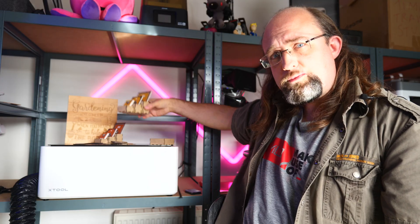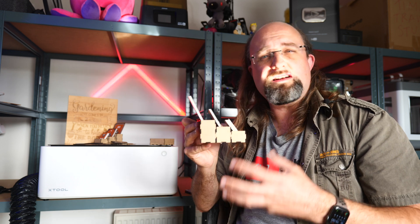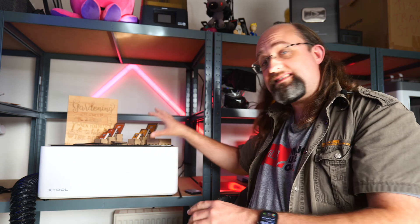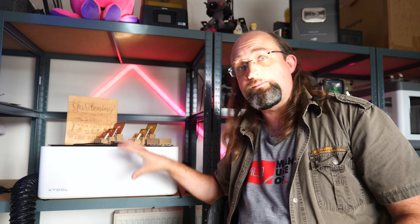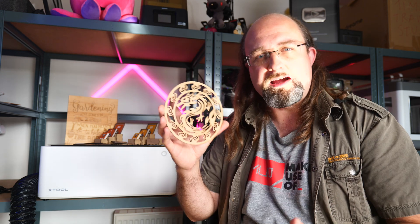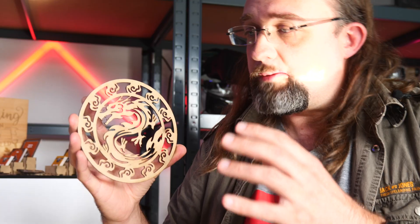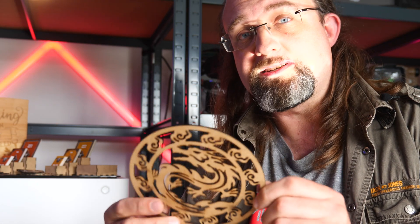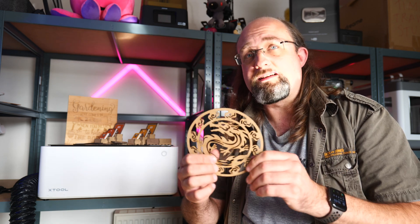I also tried with some 2mm MDF. I had to slow it right down to cut through even at 100% power, but it came out very nicely with very clean lines. You can see from the sheer number of boxes I made — and this is only about a third of them — what I mean about this being the most efficient, fastest, easiest-to-use laser cutter I've ever tried. The exact positioning camera meant I could really utilize every bit of MDF. I also tried something with really fine details: a Dragon Coaster design from VectEasy.com, and I was really pleased with how well the sharp details came out using the autofocus function.